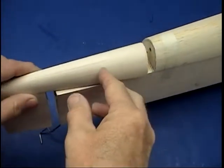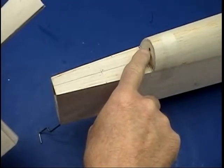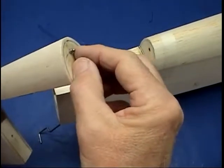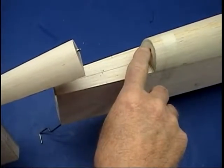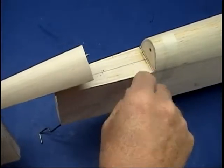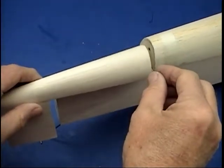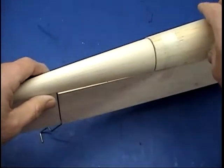I'm sure they are. Now, what I did, I put a little brass bushing in there too. I just oversized the hole and put in a little piece of tubing, one size bigger than 1/8 inch. Because in the past, as time goes by, this took a beating and got elongated, and then this part starts getting loose. So keeping a tight fit up there is one of my priorities.